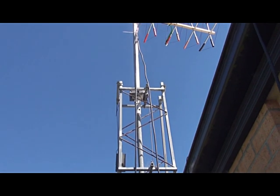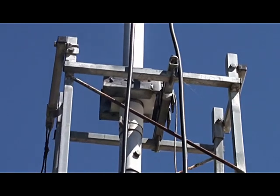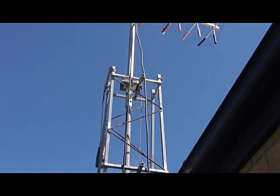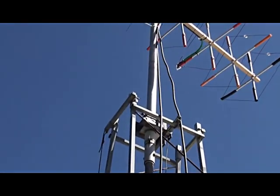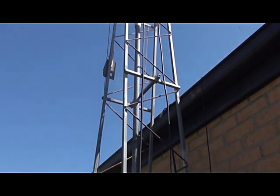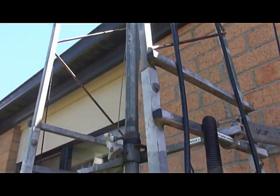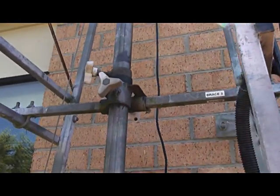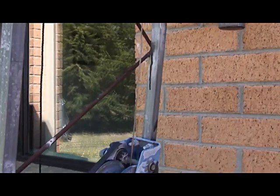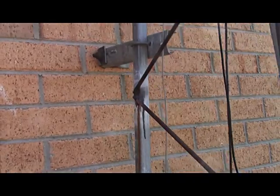This is my mast. You'll see there's a bearing there — that bearing gets lifted up. There's a piece of tubing that comes out, gets lifted up, called the swinging gate. The whole mast tubing then rotates on a pivot around here. And using the winch, we simply wind the whole tubing down to ground level or near ground level.